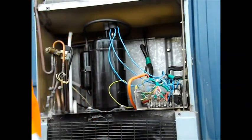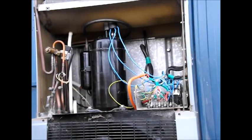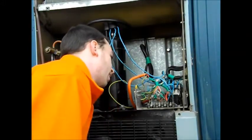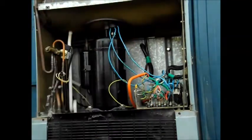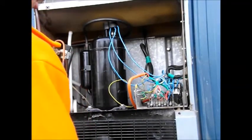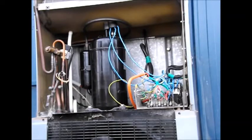The only things I haven't replaced are the contactor. I really don't think the contactor's got anything wrong with it — it's a big, massive contactor. The continuous current rating is 50 amps or something. I thought it was actually 30 amps per leg, and it's got three poles on it, so it's essentially a three-phase contactor being switched by 240. It's way overkill for this compressor, so even if the contacts were a little bit roached, it's not going to matter.